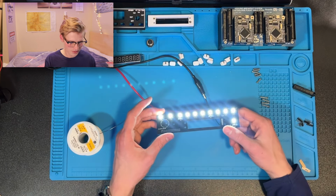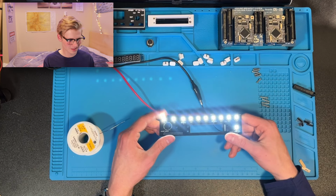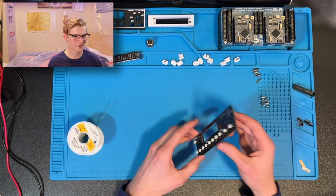Hurrah! You can also leave it on for a little. Make sure your LED calculations are good, because it'll be easier to replace the switches and LEDs now than it will be after. All right, now we can solder them.